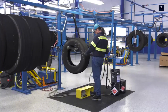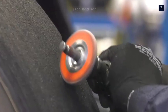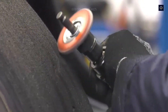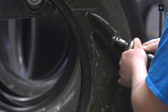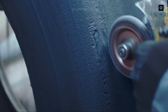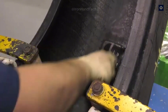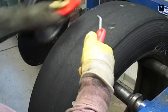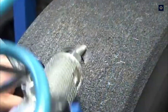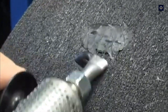To ensure durability and safety, even the smallest nicks or punctures are meticulously repaired. Technicians inspect damaged areas, fill holes with uncured rubber, and apply specialized materials with a heat press to restore the tire structure. For more extensive damage, an automated system injects liquid rubber and vulcanizes it directly to create a seamless surface.